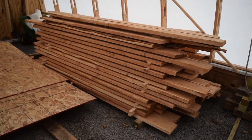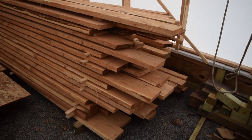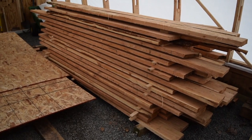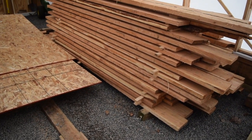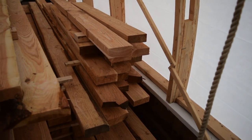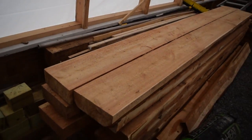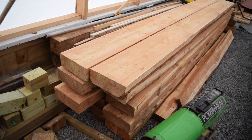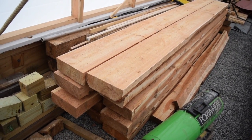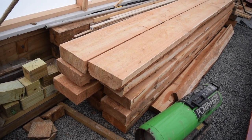Almost forgot to show you the wood we bought — one boat, some assembly required. There are large random lengths: the stuff in front is seven inches wide, six-quarter which is an inch and a half thick — that's for the keel. Down here, five inches wide, eight-quarter two inches thick — that's for the frames. And these are the floor timbers: three and a half inches, about 15-quarter by nine inches wide. I'm going to cut those down to seven inches; I kind of misordered at nine inches but bigger is better, it'll still work.